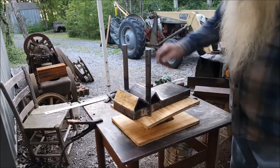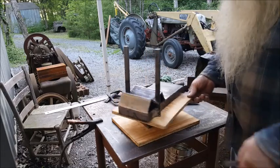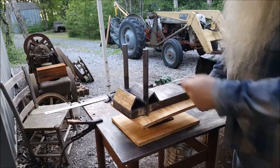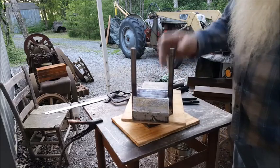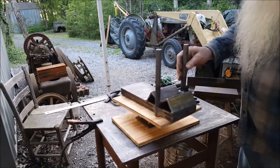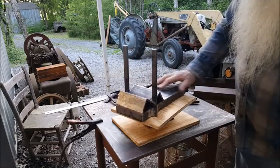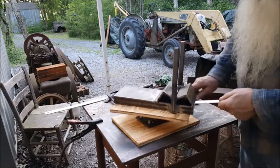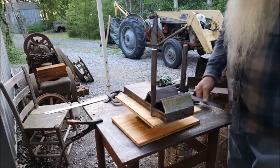Couple pieces of angle iron right there. That's 1/4 inch thick, 2 inch. I got a 1/2 inch spacer block right in the middle there, solid all the way across. 5/8 solid bar, 1018, welded. The whole mechanism there is welded together. Just cut in there and welded across there. I believe it'll be ample, strong enough.